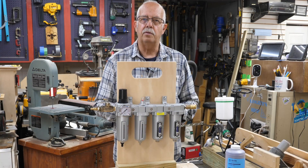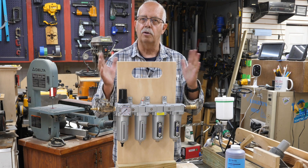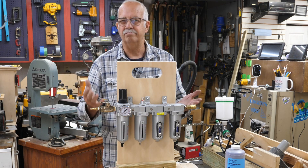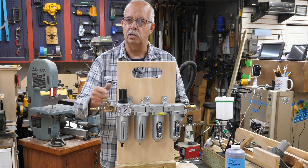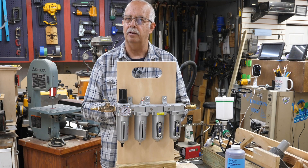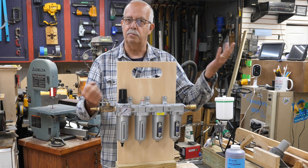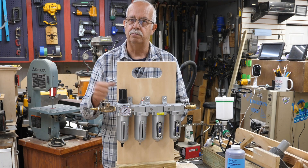This is just a quick video to give you an idea if you need a portable air dryer for your compressor. Normally portable and air dryer don't go together. It'd be nice to have a refrigerated dryer, but those are very expensive. I did this whole setup for about $230 to $235, so it's not cheap, but you don't want a real cheap one either — you want something that works. It's also important that the air hose connecting to it is already dry and purged well before you start applying finishes.